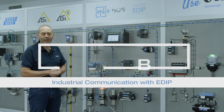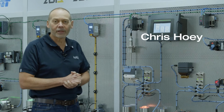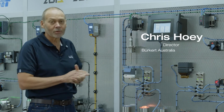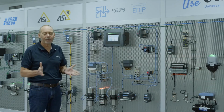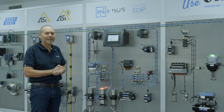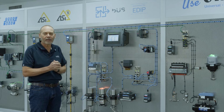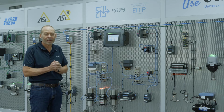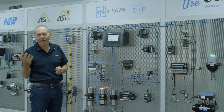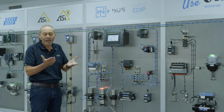This digital connect video is about EDIP, or the Bürkert BUS. EDIP stands for Efficient Device Integration Platform, which totally explains what this network is all about. Whilst it is a fully capable field bus, it is actually designed as a unique platform that connects all Bürkert devices. Bürkert has 120,000 devices in our portfolio, and to make every one of them on Profinet and every one of them on Ethernet IP, as an example, it would just be onerous.